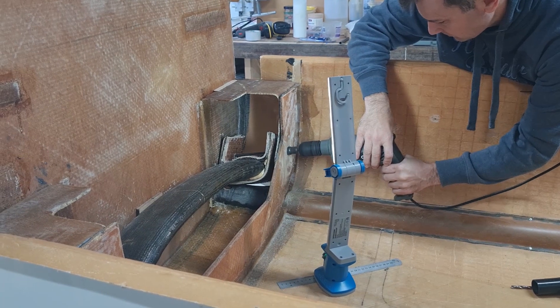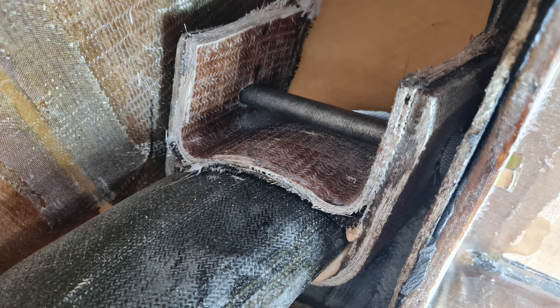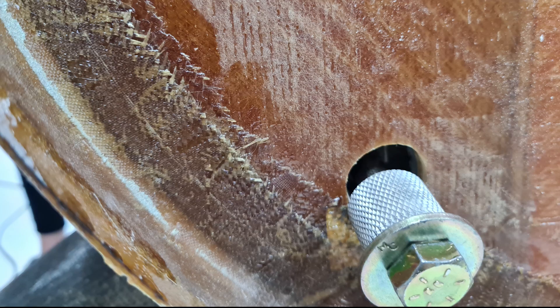These cuts were to only pass through the bulkheads. The next holes to be drilled out were to house the steel tube or the bolt bushing with the outer diameter of 16mm. Getting this hole straight without guide holes was requiring some thought, so I ended up making this guide up, which was an inch wide with an internal diameter of 16mm. It didn't work really well, but the steel tube went straight through both sides of the gear pocket. On the bulkheads, I had to grind out the 1-inch holes a little so the knurled bushings would fit.